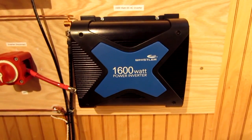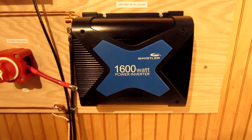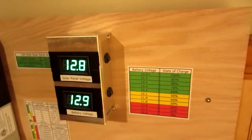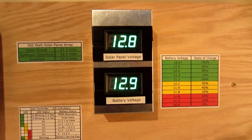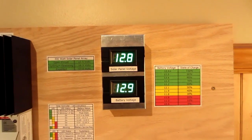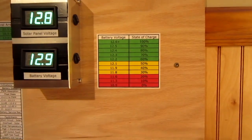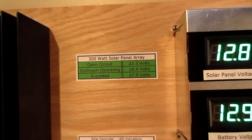The DC disconnect is a Blue Sea unit. The inverter is a Whistler Pro 1600 — a 1600-watt unit that converts DC power to AC power for use in the house. It has a peak rating of 3200 watts for high startup currents, and the 200-amp fuse will cause it to shut down at 2400 watts. I also have a small box with two digital voltmeters measuring the solar panel voltage and battery voltage — I got those voltmeters on Amazon for about six dollars each; they're made by Smakn. I also made a couple of charts to quickly read the system status.